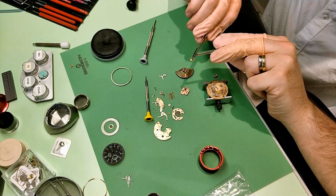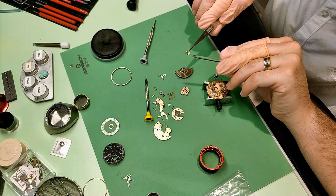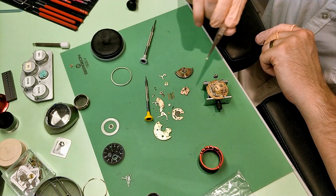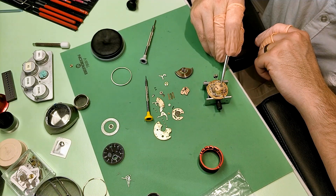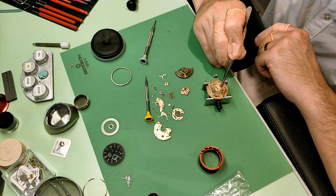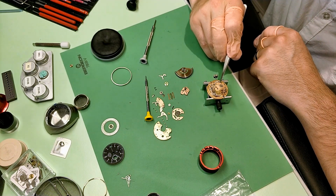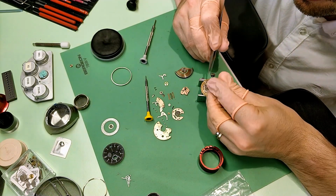So it's a real art, and you have to oil everything. And on the bottom of it, you've got this little part there. It's called a finger. If you have the 861, at the spot there, you have a minute recorder. And the finger just touches a little wheel between there, the intermediate minute recorder, we call it. Simple as that. Then flick one tooth, the tooth just transmits to the minute recorder. It's kind of sweet. Little cute, yeah, it's quite cute.